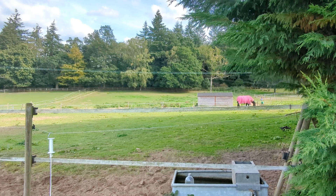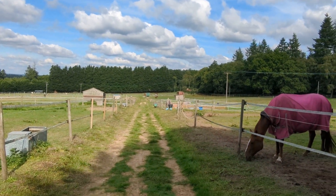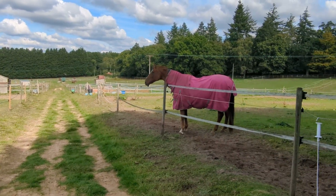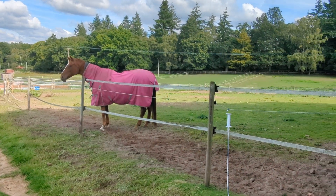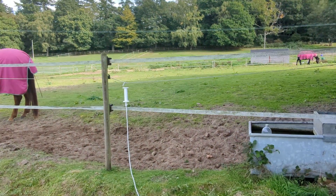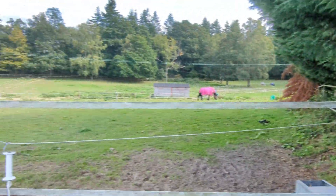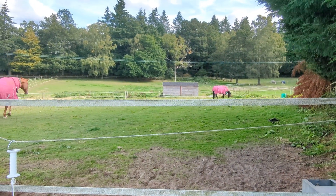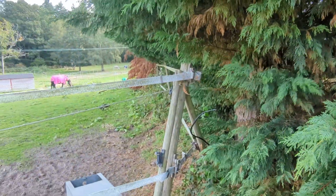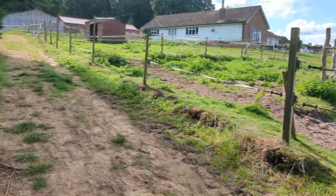The top tip here: treat it like a normal electronic circuit — you've got positive and negative, and you need to keep them as far apart as you can. High voltage is a lot easier to short than low voltage; it will jump over damp posts and trees. So we want to keep that from happening, and if you can break circuits up, that allows you to isolate sections.